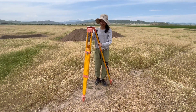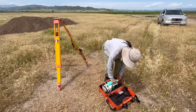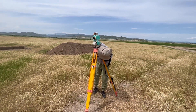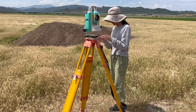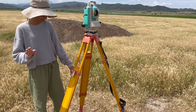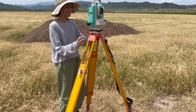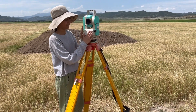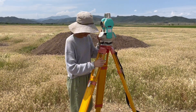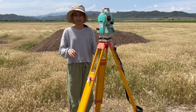Here's a little screw, so first you're going to just get it up and get it to stand. I'll get the total station out — careful with it, don't break it. There's a little screw over here which you have to match up and then tighten. After setting up the tripod, what we want to do is make sure it's balanced over the pin, which marks your coordinates — that would have been taken prior to all of this. Make sure all your legs are locked, then you want to look through your downscope which is right over here.